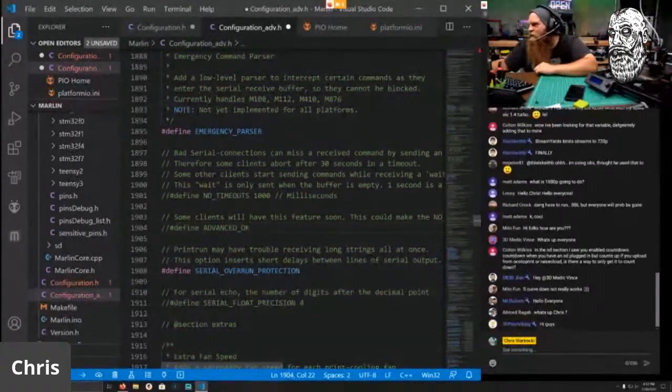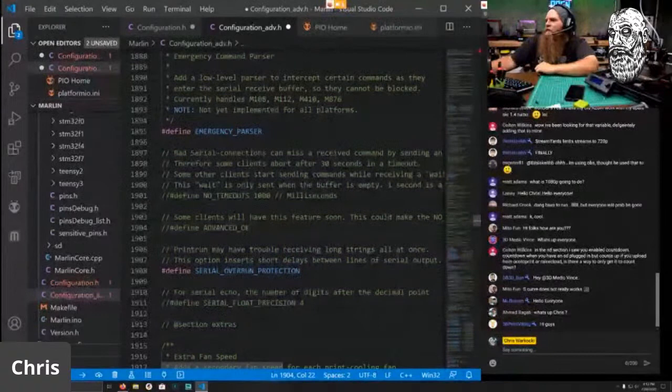In the SD section, enable countdown. Countdown when you have an SD plugged in, but it counts up if you upload from the host. You can enable M73. That should work. So that will take what your G code does for the timing. I have had it work and not work.